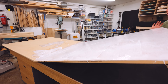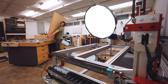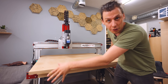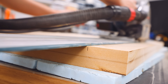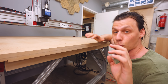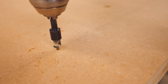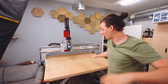That was only slightly stressful. After the glue had dried on my MDF, I cut it to size — slightly larger than the working area of the machine so it extends toward the front and overlaps the sides a little. That meant cutting a small recess with my handheld router, which created a ton of dust. I attached the whole thing to the machine using strips of plywood screwed into the aluminum extrusions underneath, then countersunk regular wood screws deep into the sheet and into those plywood pieces so the screws are nicely tucked away.